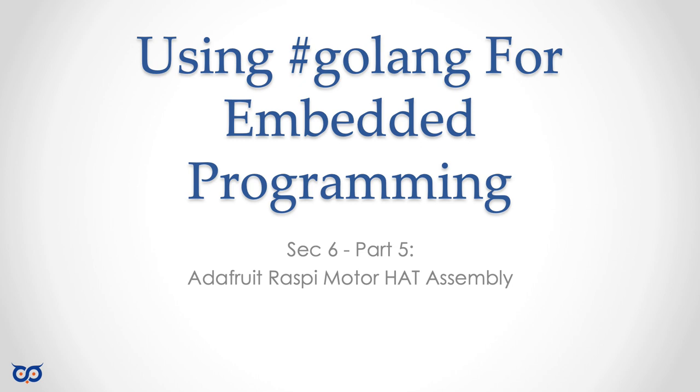So in the last two videos, part 3 and 4, I had some issues with the SB Components Raspberry Pi HAT. This is a board that's supposed to use GPIOs to control up to 4 motors, only we're trying to get it to work with 2. There's a Pi library that seems to work, and technically Gobot should be able to use those GPIOs the same way and control the motors, but we weren't getting it to work.